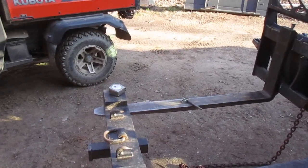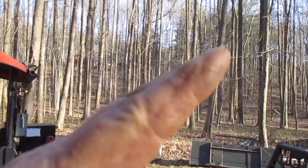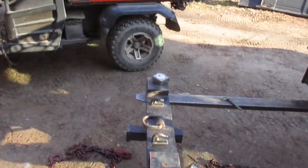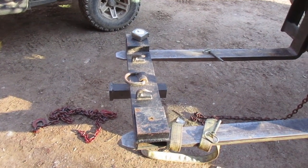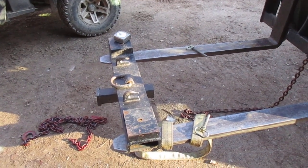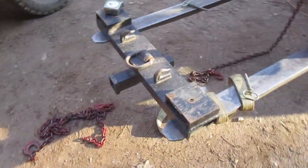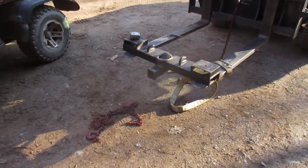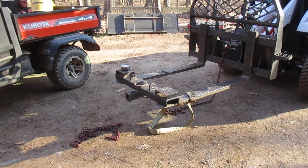As I told one person - if you raise your forks up and tilt them way up, you can get two more feet of height out of the tip if you're trying to lift something and set it into something, which might come in handy. I think I've run out of things to say. I think you're safer with holes in the forks in the proper location with an attachment like this, even stronger than trying to just put a chain over the end.